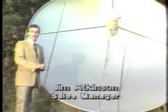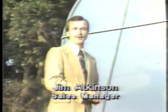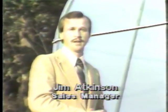Hi, I'm Jim Atkinson, and we're here to discuss the stainless steel antenna. Here at Qualtronics, we feel the antenna is the most important part of the satellite receiving system. And that's the reason we have chosen stainless steel as our leader. We use 16 gauge number 304 stainless steel as the material in the reflective surface. The reflector is made by a hydroforming process.